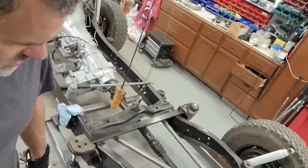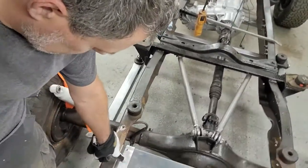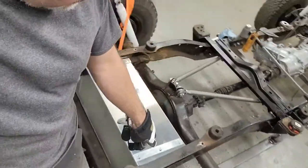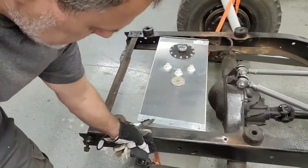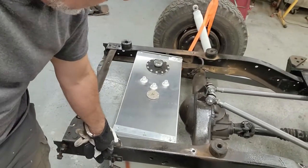So that's where we're at right now. I'm going to try to get this tank mounted up — just going to weld on some flanges and bolt right down to the frame. I've got good access from above here. There's about four inches of space under the body, between the frame rails and the back of these little Bronco 2 bodies.